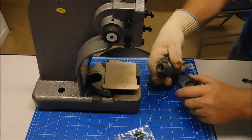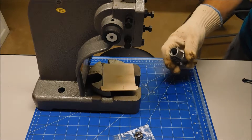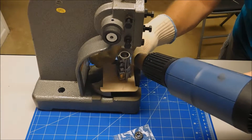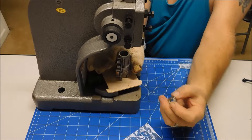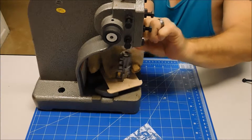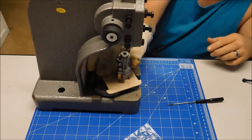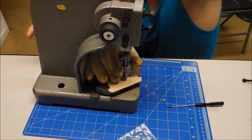I'll start heating this up here. I've got a temp gauge so I can shoot the temperature — 162 degrees. I don't know if that's going to be warm enough to actually help it out or not, but let's see if it's hot enough. I want to put this bearing in with the shield part facing forward, and that thing is quite warm, so I really want to make sure it gets on there straight. And our bearing is in.